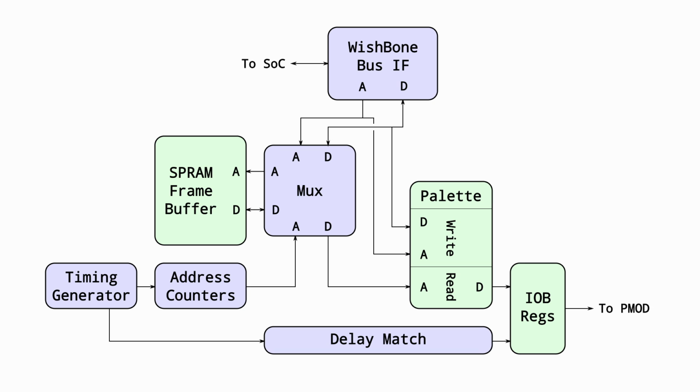You just need to update the DMA base address at each frame, flipping between two buffers in the main memory. The logic to implement this is rather simple, and I actually already have something very similar in the memory test example I wrote for the SPI controller core. The complexity comes from the cache.